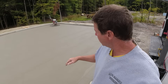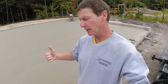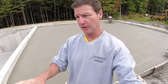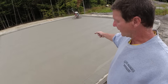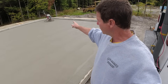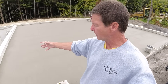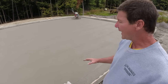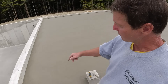That went really good — perfect timing. You can see the pattern I follow. When you lift up on the handles of the power trowel it goes to the left; when you push down on the handles it goes to the right — that's how you control it. I like my finish pattern going to the left, then I come back to the right, keeping the top of the cage at the bottom of my finish pattern when I come back. On the return I split the two in half — that's why the pattern looks so neat. It helps flatten the floor even more and fill in imperfections, just like when I was mag floating.